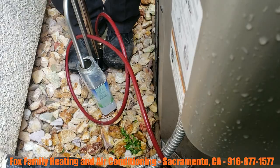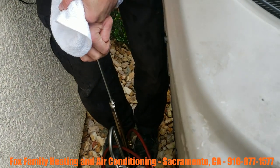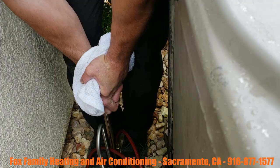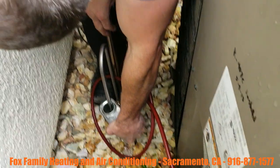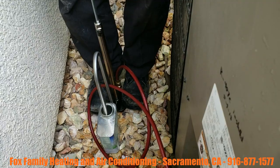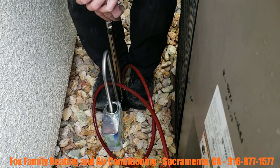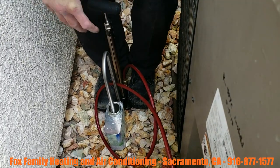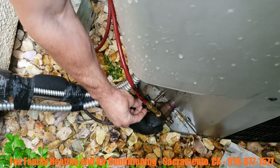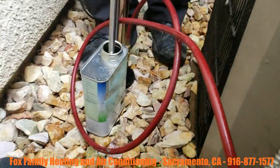We're actually pumping oil in right now — about two ounces per draw — just drawing it in and pushing it back out. We're gonna do this about four times. What we're trying to do is introduce 15% POE to the total oil capacity inside the compressor. So if the compressor came with 20 ounces of oil, we're just gonna add 15% of that. There we go, that's good enough. Now we can start this system up and since we're putting it into the suction line the oil will go right into the compressor upon startup.